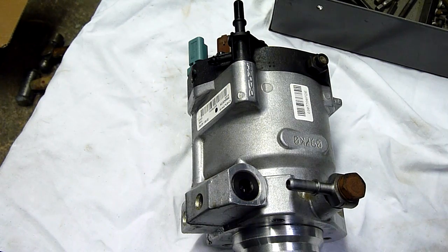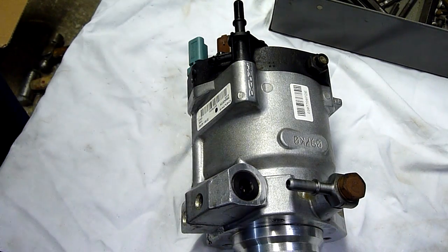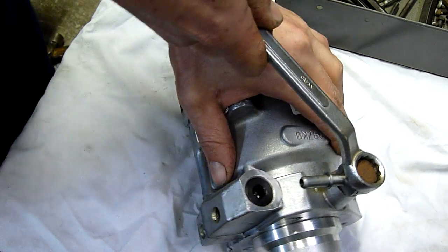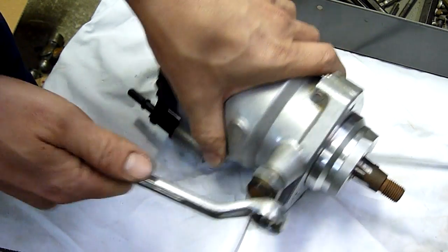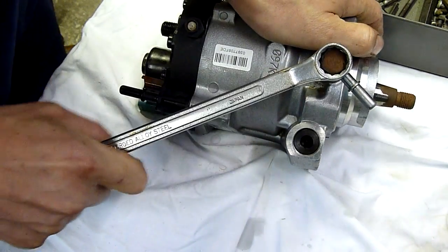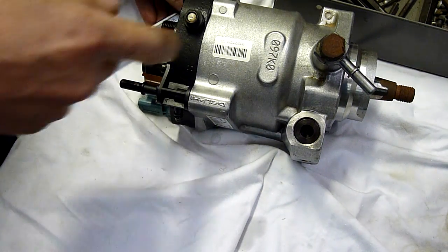This came off my manager's Hyundai Terracan CDI. It's a Kia built engine, 2.9 litre, 4-cylinder. It just suddenly decided to start playing up one day, and the pump was putting metallic debris into the injectors. Destroyed the injectors and everything, and when he went to Hyundai about parts, well, they wanted him to basically bend over and take it without lube, just like this pump probably did.